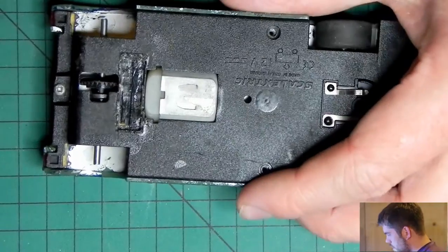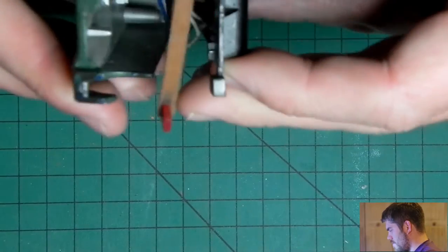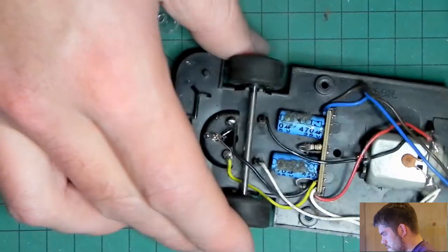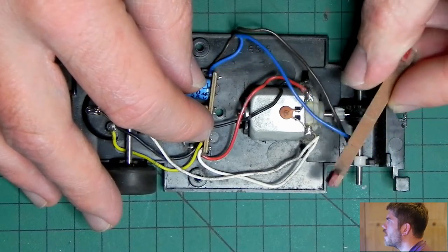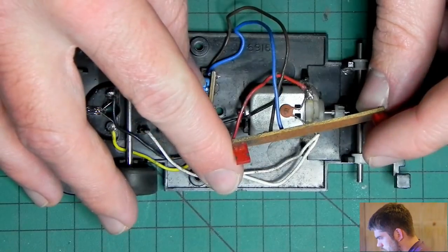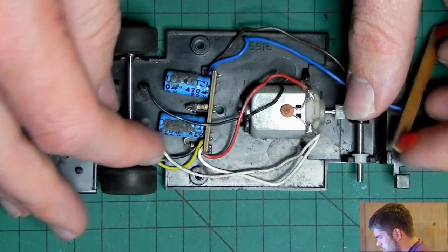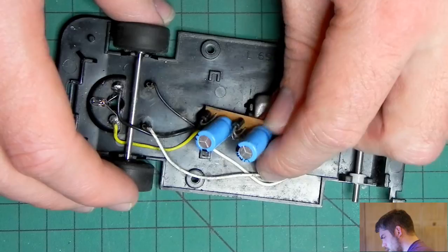So I guess I could get on and glue the wheels on, but I'm going to take it apart first and have a look at the innards. It's quite dusty. When these cars were new the brake lights did actually work and I suppose if I'm playing by the rules I ought to fix that. I can see just by looking that these LEDs are blown. I don't know why they'd be blown, but it's possible that just by replacing the LEDs I'd fix this.